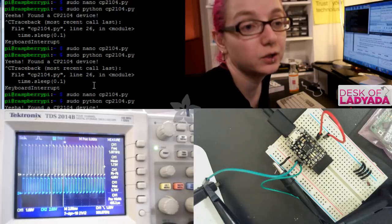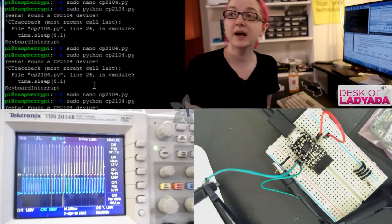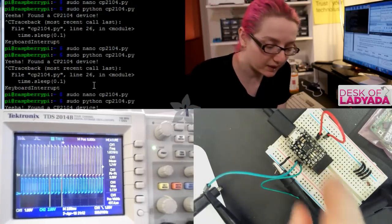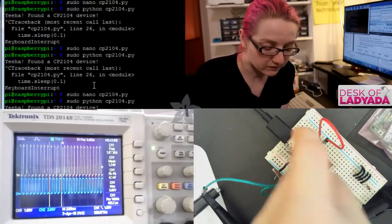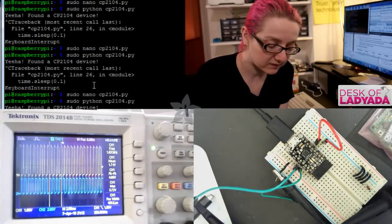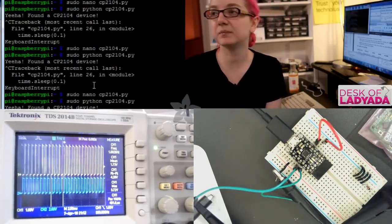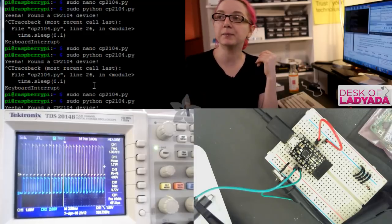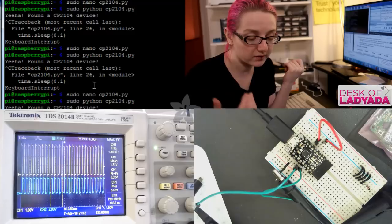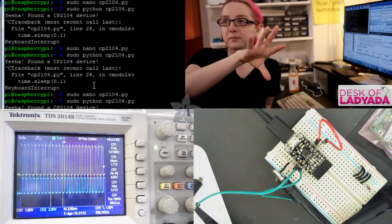So that's how you do raw data control transfers to USB devices. So now that I have gotten those GPIOs working, I've been able to test every GPIO. I, of course, tested the RX and TX. That was easy. The 5-volt and 3-volt pins are easy to test. The reset pin is easy to test. The suspend and unsuspend pins, I figured out how to test by unbinding the device driver in Linux. And the other control lines are easy, so the only thing I had to do was figure out how to test these pins.